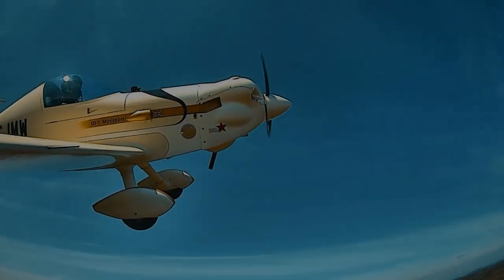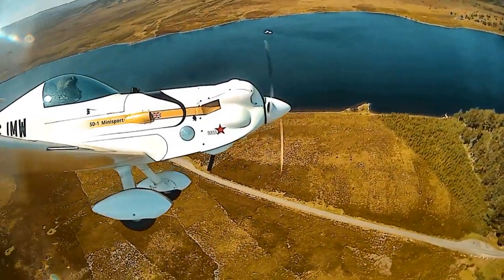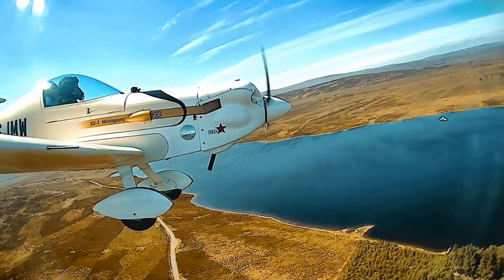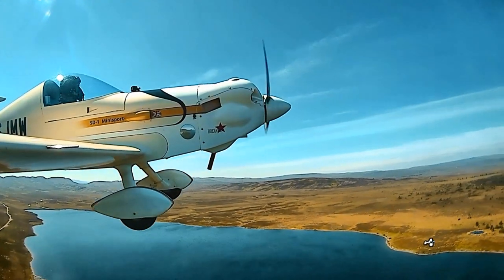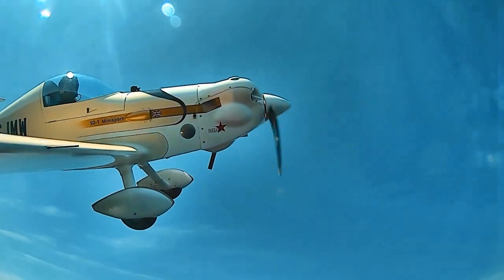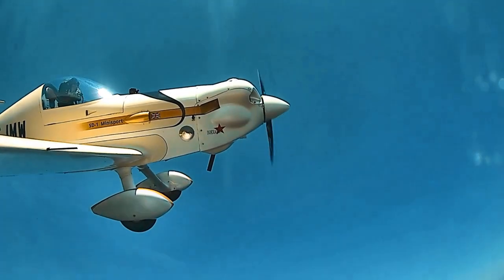Okay, let's move on to the fuel supply problem. After the last 50-hour service, I suffered a loss of power on climb away from low level. At the same time, the RPM indications fluctuated wildly between 2,200 and 4,800 RPM, an impossible figure. I quickly switched on the electric booster pump and things immediately returned to normal.